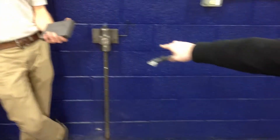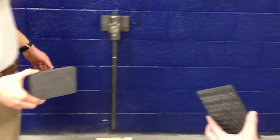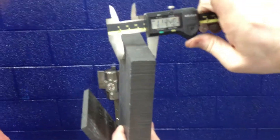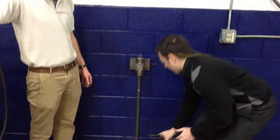So what we're going to do is drop this 13-pound hammer onto the carbon-carbon piece and the fine-grained graphite piece. The carbon-carbon piece measures in at about 0.284, 0.285 inches. The fine-grained graphite piece is quite a bit thicker, measuring in at close to one inch. So the fine-grained graphite is about three and a half times thicker than the carbon-carbon block. Let's see what happens.